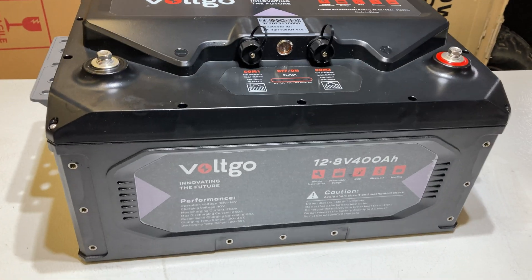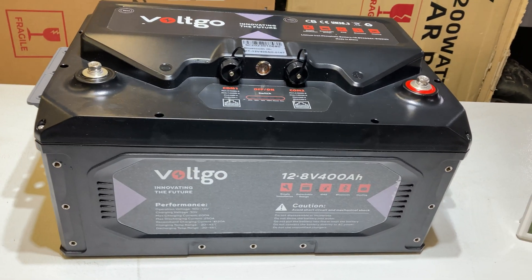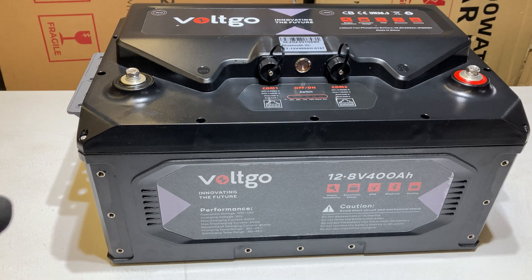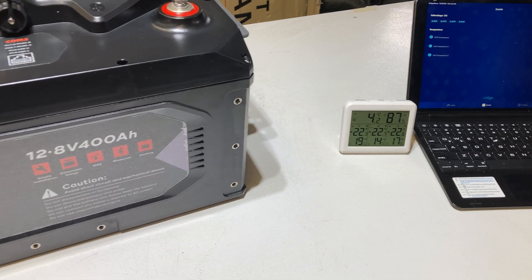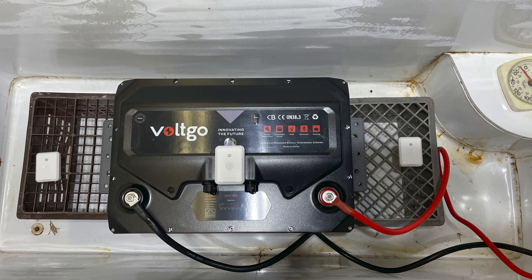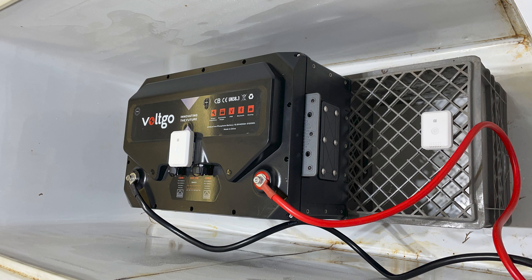We're going to put this in a medical-grade freezer and get it down to around negative 20°C to see if the internal heating works. We'll look at it with a FLIR thermal imaging camera — getting pictures before, during, and after — and watch its profile. I'm going to hook this up to an inverter that powers the entire test, making it a standalone test from this battery. Three white temperature sensors are set up: channel one on the left, channel two on the battery, and channel three on the right.